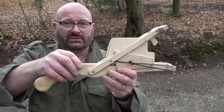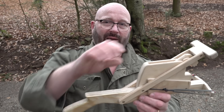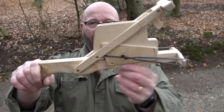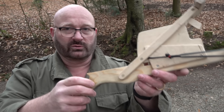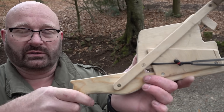And of course you can repeat. So now we simply have to make this a full rotation so that I don't have to push it back anymore but rotate it the whole way. I have to get rid of this lower part and lift it all up so that I have space to rotate it. And since I have a powerful drill, I don't need the lever — I will be turning this pivot point here directly. That is the way to go. Sure, let me show you what I came up with.